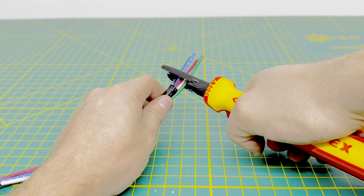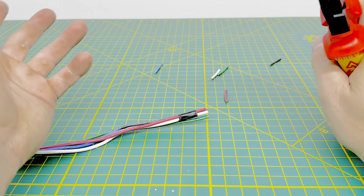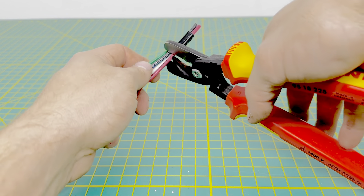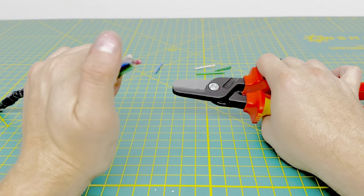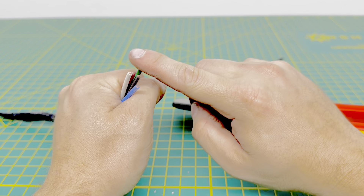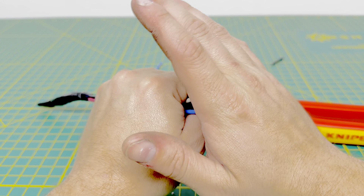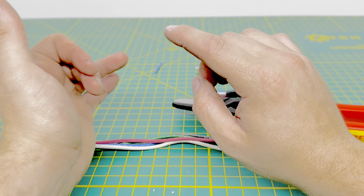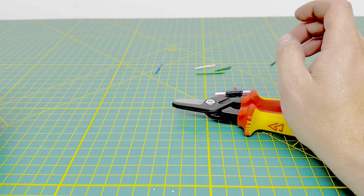We have some wire here from a leftover wire pull. We'll go ahead and cut through all five conductors — four conductors and a ground, if you want to get technical. It cuts through all of those conductors without an issue, and it does leave a relatively nice and smooth cut behind. Not like when you use a pair of lineman pliers or diagonal cutters where it kind of just pinches the wire and leaves that rough, jagged edge.